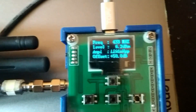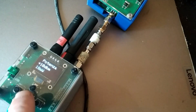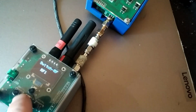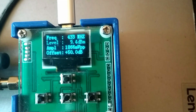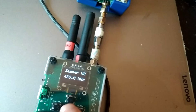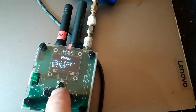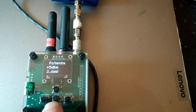In this part of the video I measure the output power. The power is not very precise due to a switch and power loss in the system, but for my use it is not very important — it is possible to set the register to adjust the power. To switch the antenna I use 2 chips: the switch chip HMC349, which has 1 input and 2 selectable outputs. The impedance of the RF trace on the PCB is 50 ohm. I did much testing to understand coplanar waveguide design and achieve 50 ohm. I tested the trace with an order PCB and used a NanoVNA for testing impedance and return loss. Testing from 300 MHz to 900 MHz, I measured an SWR of 1.04 to 1.06 — it is not exactly 50 ohm across the full range, but for me it is good.